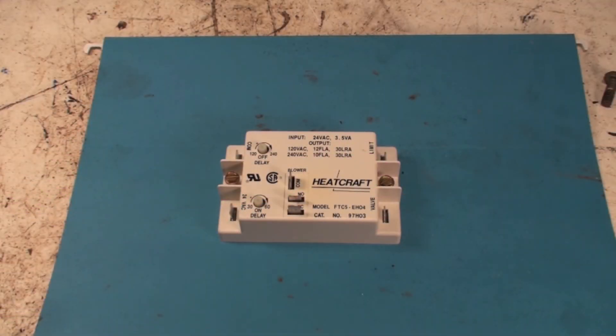This one's about electronic fan controls. I've shown you this thing — it was inside a Lennox from about 1992. This was kind of an in-between thing; they were trying to eliminate heat-operated fan switches, and so they came up with these electronic fan switches which would delay the on time of the fan motor.